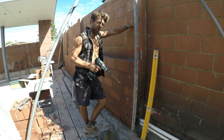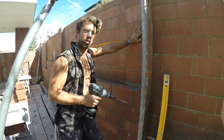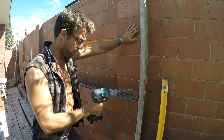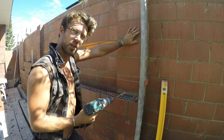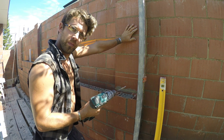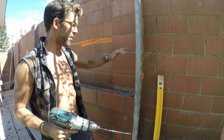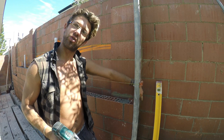Here I'm going to explain how to tie into an existing wall. When you're building walls, you obviously leave wall ties to attach walls. But in this case, I'm applying a wall to an existing wall, and there's obviously no wall ties. So I'm going to drill two holes and then insert some rods which will act as a wall tie. It will fix it securely to that wall and also stop that crack where it's joining.